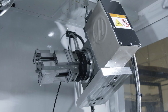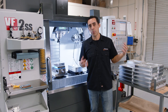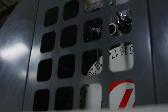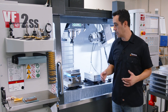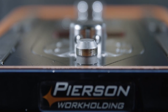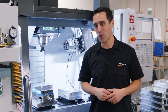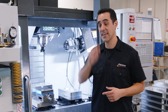Another thing we try to do with this machine is work through standardizing the tools and parts going through it. Once we know what types of components go through this machine, we can standardize a tool list and keep the drum magazine fully loaded — doing only one setup. These pro pallet bases have their own individual work offsets: G154 P1 and P2. Those are standardized — we use the round pin for XYZ and the top of the Z pads for Z zero. Let's head into my office to answer the question you're probably sticking around for: how much did I pay, including hidden costs?